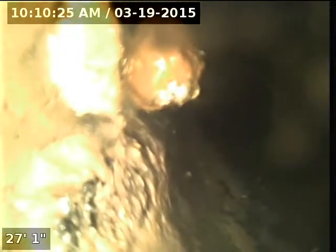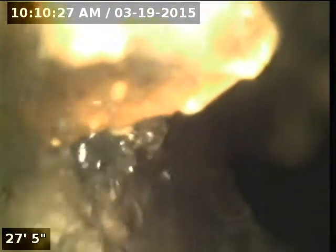There are more solids here in front of me at about 21 feet, and another solid here — quite a few different solids. That definitely has to do with buildup in the pipe and possibly a grade issue, but more of it looks like just buildup in the pipe. The line definitely needs to be flushed out and/or hydrojetted.